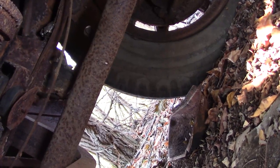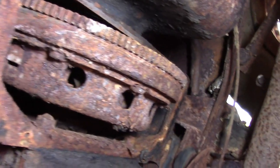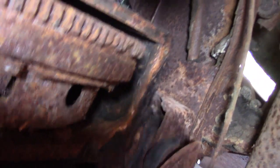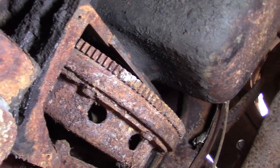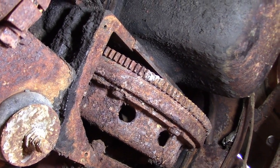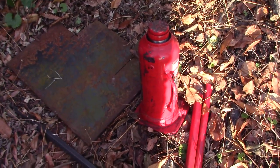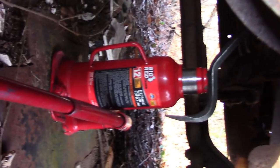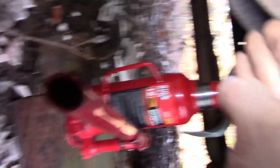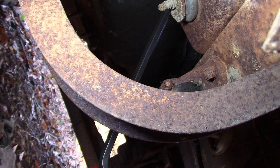When I took that inspection cover off the bottom of the bell housing, it was completely packed with mouse nest, and they've done a number on the ring gear - there's actually some teeth that are basically missing, just corroded out from all the mouse pee. I put a bar on the flywheel teeth and she ain't going to budge. So I scrounged up a flat plate of steel and a bottle jack. I got the pry bar jammed in the teeth of the ring gear and ran that down to the bottle jack, and pumped it up until the pry bar assumed a nice recurve shape. My plan is to just leave that with some tension on it, go home, and come back in a couple of days.